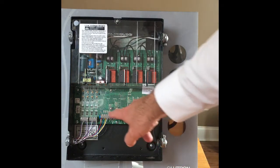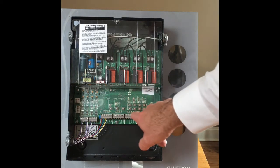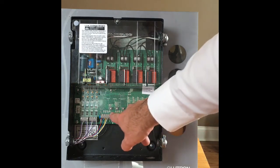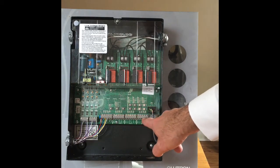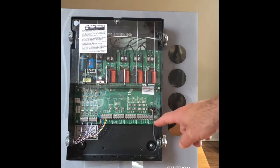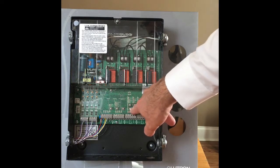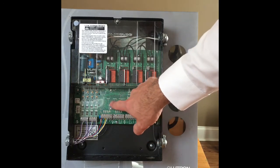This unit also has the ability to power occupancy sensors — we can do four occupancy sensors. We can also do daylight sensors, 1 through 4, directly from the unit. We can do a low voltage dimmer or low voltage switch. And we can also bring in a standard contact toggle switch and program it right from the unit. There's a basic way to set this up which allows you to turn things on and off and dim from here for test purposes, and also to set up these sensors with some very basic programming.